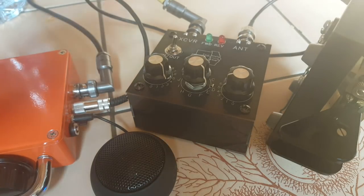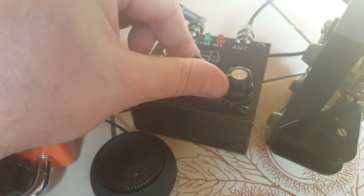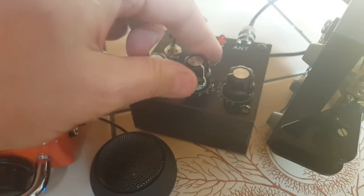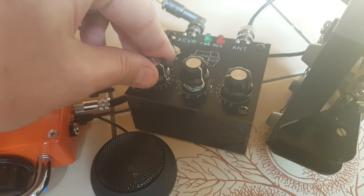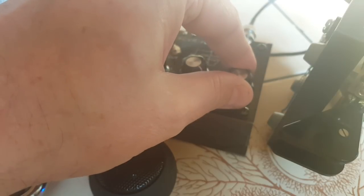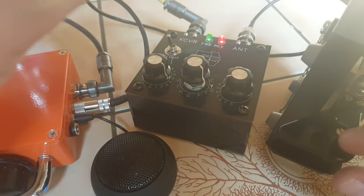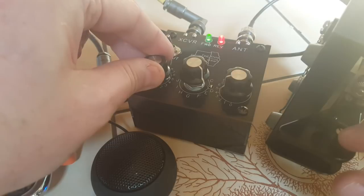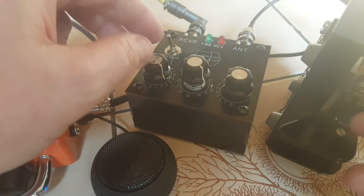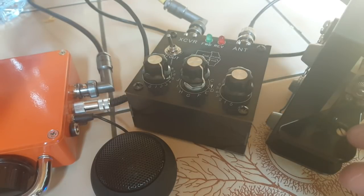Quick test before I take one outside. It seems to operate fine. I put the switch on 'out,' which means operate, and I search for the loudest noise. It seems to be on E, then I turn the left capacitor — it seems to be around four and about here. That's where I get the most noise. Then I go to 'in' and key the transmitter, playing with the capacitors until I get the least amount of brightness out of the red LED. The red LED ideally should be practically out. You can see that the green LED is much brighter than the red one — and that's what you want.